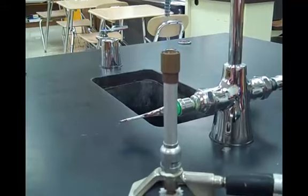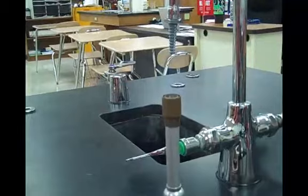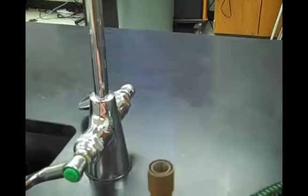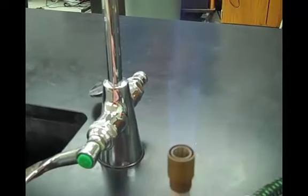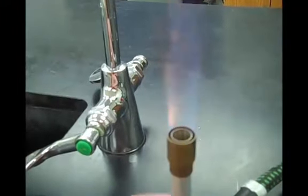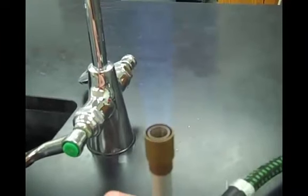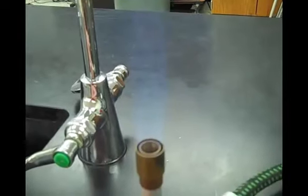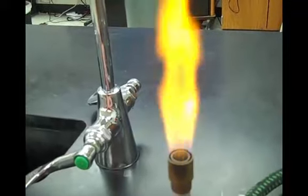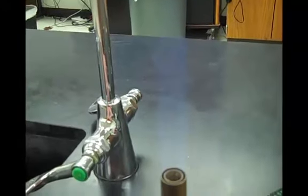I'm going to turn the gas down just a little bit at the source, and we get a nice blue flame — that's a good blue flame. I'd call this a low heat flame; it's not all that hot. If I want to continue to open up the valve by rotating the tube, I'll turn this into a hotter flame where we get a nice blue cone in the middle. You can continue to turn it quite a bit to open that flame up — so high heat flame. If you want to go back to a low heat flame, we can close that down, let less air in, and we'll get a softer flame.